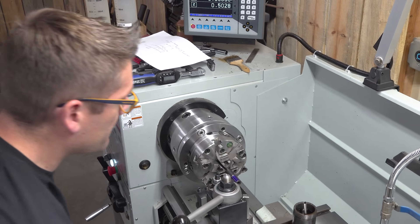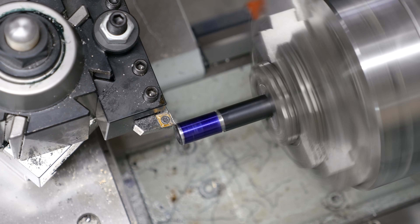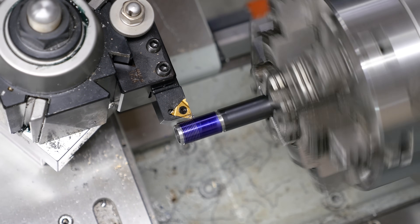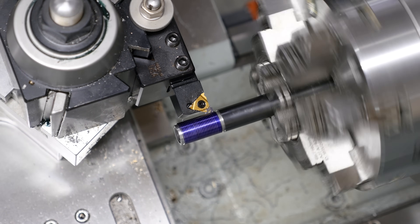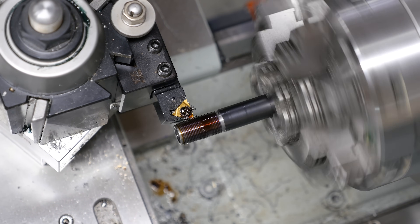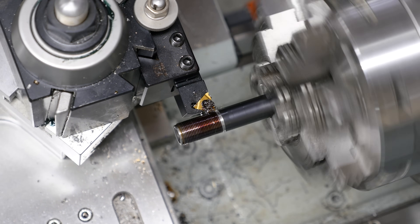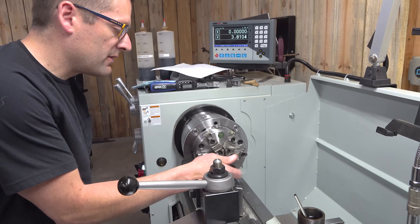The threading is where the zen really comes out. I was basically using a visual indication on the peaks of the threads to know how deep I needed to go. I also knew that this particular thread protector has a certain feel to it when it gets threaded on. I started at about five thousandths of an inch per pass, then went to two, then to one, and finally ended at one-half thousandth — that gives you that last really nice clean-up pass. The compound is set at twenty-nine degrees so we're cutting mostly on one side but also cleaning up incrementally the right-hand side of the thread. It threaded right on — no problem. The magic worked.